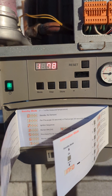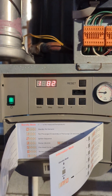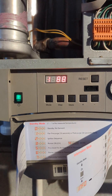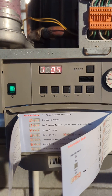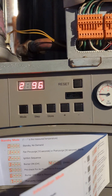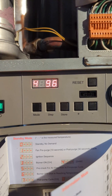She's on — pre-check for airflow now, pre-purging. Let's see how it works. There's a new igniter in there; that's the old one. It should be just one click — number two ignition. It's a brand new igniter, so now it's firing up.